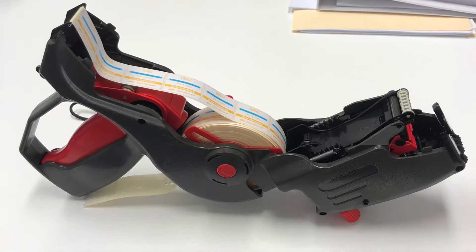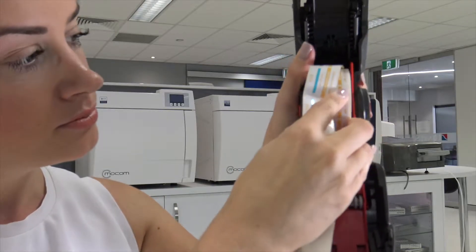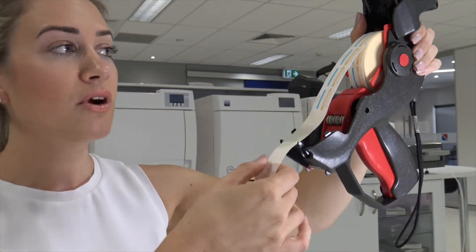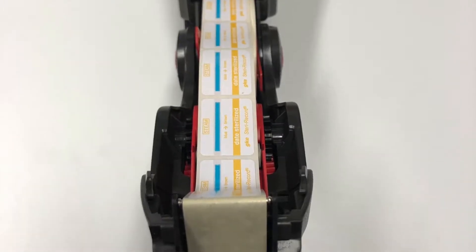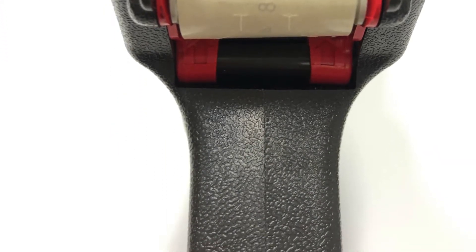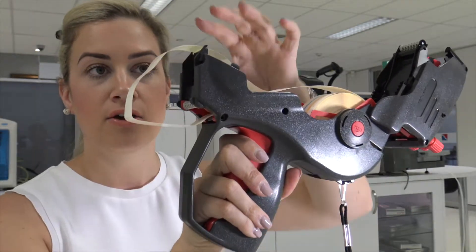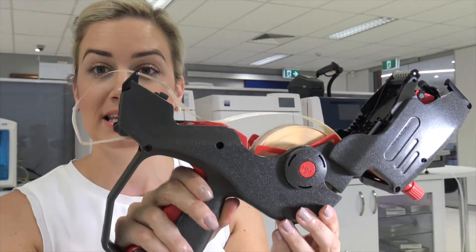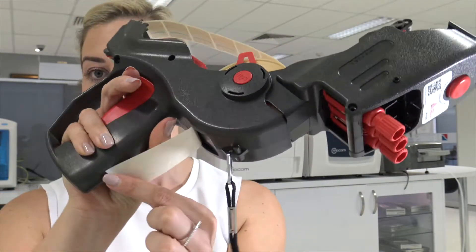With the label facing outwards, just push the labels into the gun until it clicks. You can see here I've got a healthy reel of label left. There are two red arrows and we want to feed the label in and through here. When doing this it's easy to press the trigger until it grabs the bottom label part — you can see that it's now starting to feed in and becoming taut. Keep doing that and you can see now it's just fallen through the bottom.